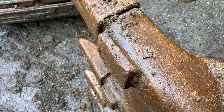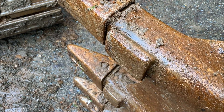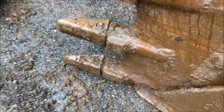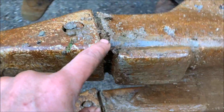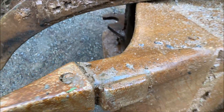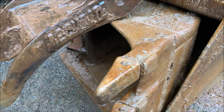This was a little bit thinner steel — it originally was probably a three-quarters, seven-eighths — it had worn down as a bucket edge, but it is doing its job. I didn't do side ones on here, so that could still stick out further, but the chances are fairly slim of hitting that one and blowing a tooth off. The bottom ones, most definitely.